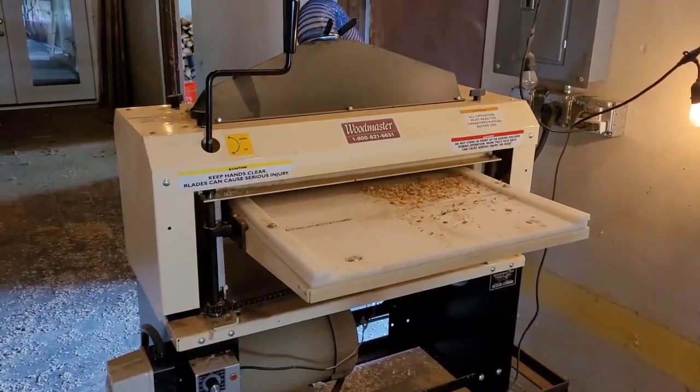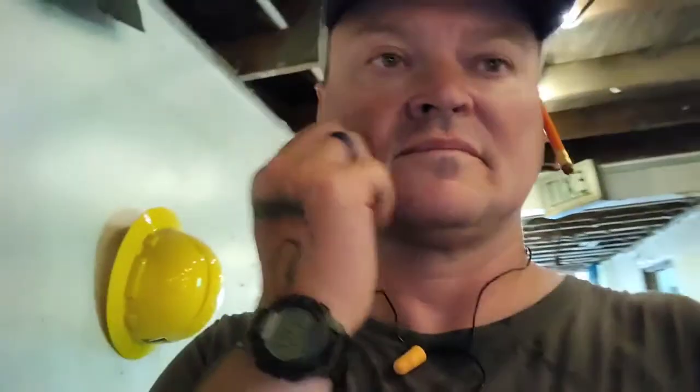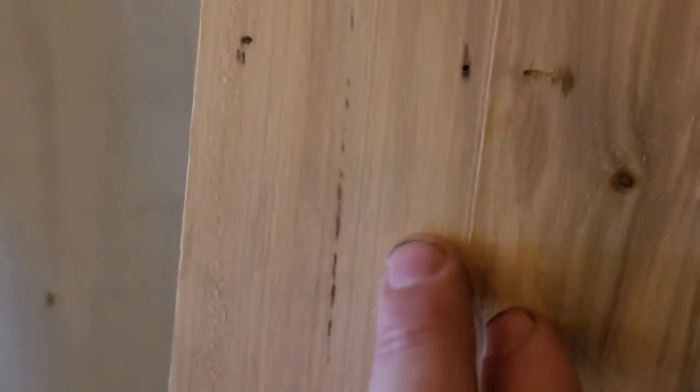It's got the helical cutter, which is pretty fantastic. I have not done anything to my helical cutter. I did hit a nail once — a big 16-penny nail went right through it. I thought I had noticed it always left a little line, but I believe it just always leaves little lines. You can probably see them — the lighting's not very good in here. See right there, there's a line. That will just sand off no problem.